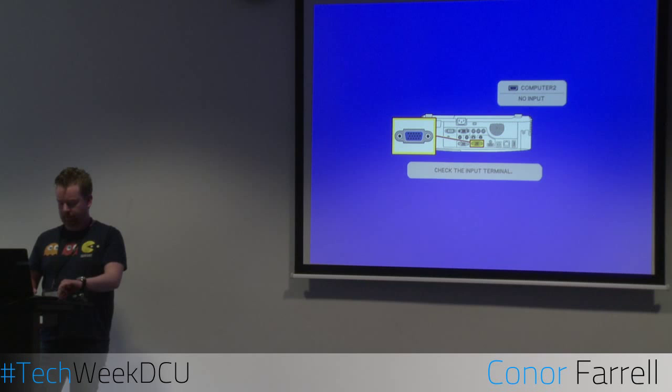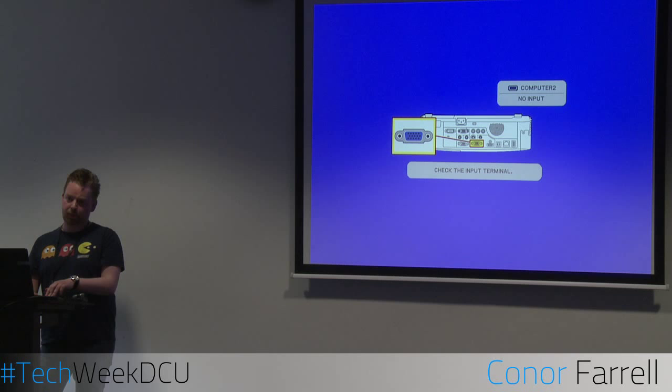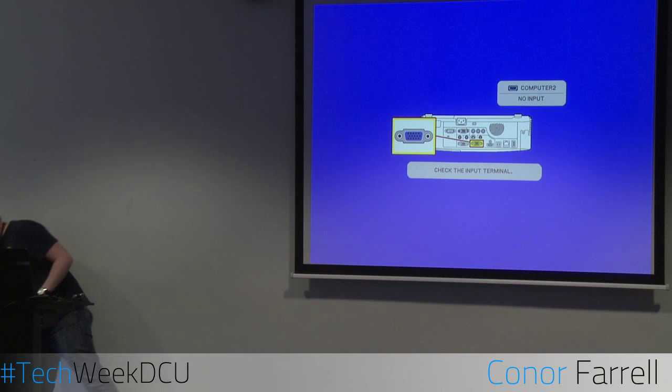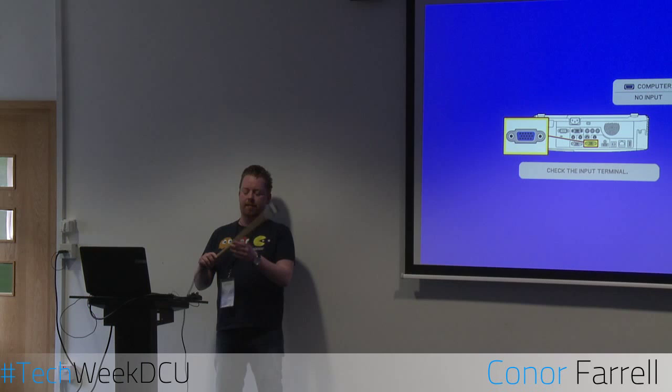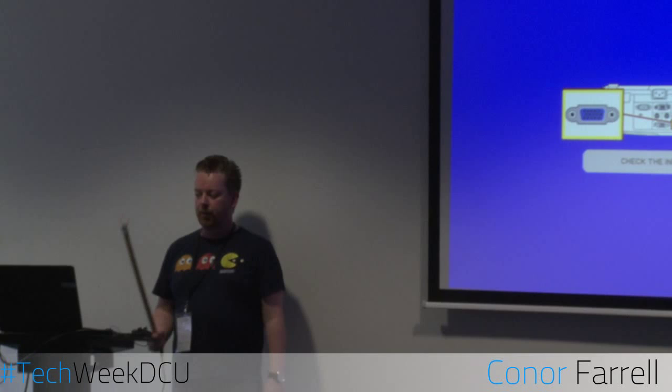Where's the good place to get antennas? Build them. Yeah, they're easy to make. You can pay a lot of money for an antenna, which at the end of the day is just a couple of pieces of wire. For example, this one here that I made is a collinear antenna. It's an array of dipoles. They're about 7 centimeters long or so the whole way down. And it's tuned exactly to 1090 megahertz. So that's a good high gain antenna for grabbing aircraft.